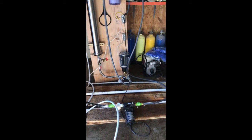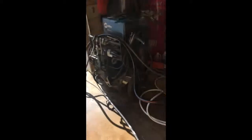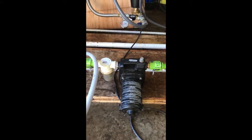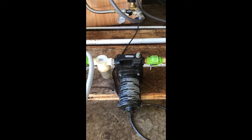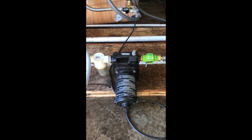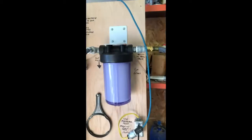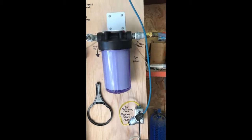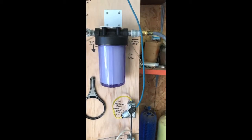The system is coming in through this black hose, which comes in from the RO storage tank. It comes into this transfer pump through a screen filter, and this pump puts out at about 40 PSI and can pump up to 1,500 gallons an hour. You have to have a low pressure pump to feed your high pressure pump. That comes out through this gray hose and goes through this 1 micron house filter — a 4 inch by 10 inch standard filter. It takes out all the small particulate matter and keeps the RO membrane clean.